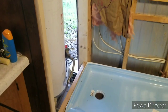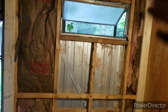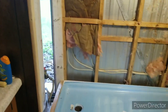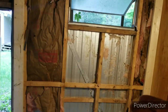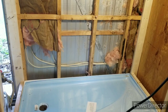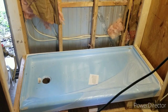There is a tub surround that goes in here but they want to keep the window, so I'm already going to have to cut the tub surround down — this is an eight-foot ceiling and the surround is for an eight-foot wall, so it won't fit as-is. After this is in and I get the drain hooked up, I'll do the faucets and make sure everything is functional and drains the way it should. Then I'll start worrying about the surround. It's just a lot of measuring, going back, and double checking — making sure I'm not royally screwing this up. Like and subscribe, leave comments below, and I'll see you later.